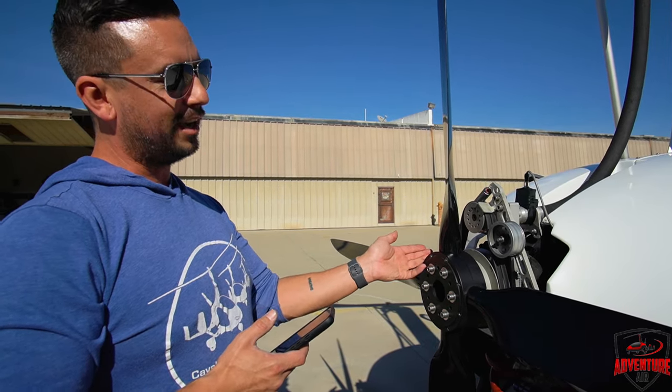We can tell the motor mounts are very soft. The whole motor is shaking when we move the prop, and they just need to be replaced overall. The prop was out of balance — we did balance it, the blades weighed different weights and we got that all correct. But you're not gonna need this much weight on a propeller to balance it. We put this much weight on in multiple locations and we were getting the same spot on the sensor showing it was out of balance. That tells us it's not an imbalance of the propeller — there's something else going on. The engine's just shaking in the bay by itself.